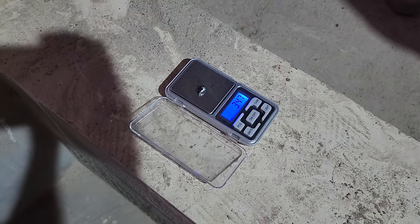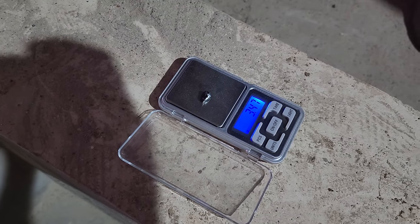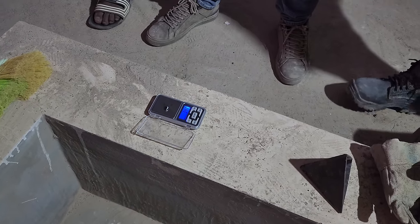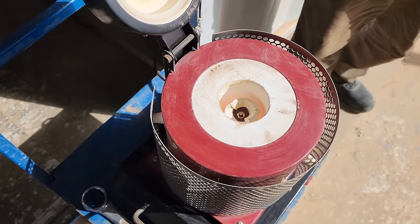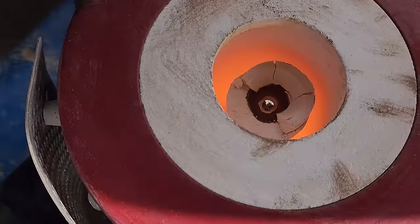Yeah, 3.5, that's not too bad. Closer to 4. Yeah. I've experienced you always lose a little bit of lead. Yeah. Bismuth actually seems to be better. You don't lose as much. Okay. But with lead, it's hard to get. If you can get within 10%, you're doing pretty good. We're working on a little cupellation furnace now.